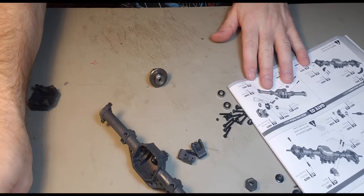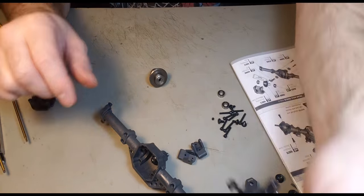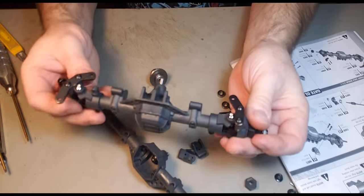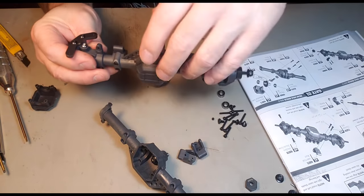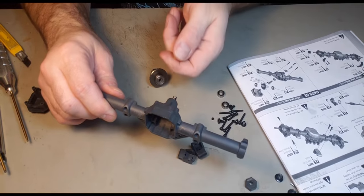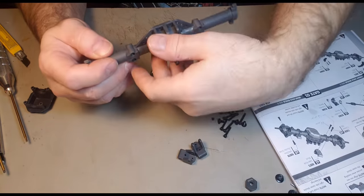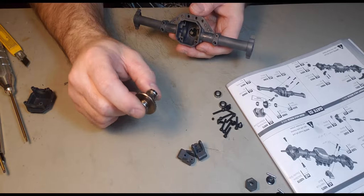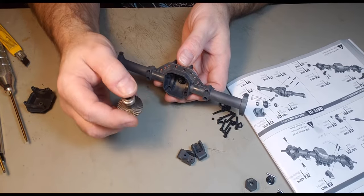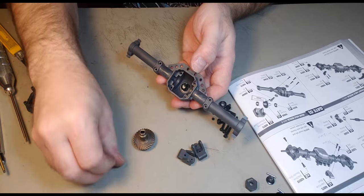While the front shaft was assembled this way, the rear shaft is assembled the other way. So in my case the shaft will be facing me; in your case it will be assembled the other way. It's important to keep the proper orientation when you're building it, because the spool needs to go in a certain direction. Otherwise, like I said before, you're going to have the front going one way and the rear going the other way.